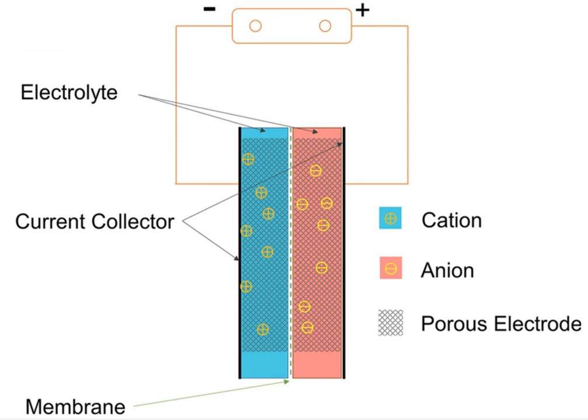The amount of charge stored per unit voltage in an electrochemical capacitor is primarily a function of the electrode size, although the amount of capacitance of each storage principle can vary extremely. Practically, these storage principles yield a capacitor with a capacitance value in the order of 1 to 100 farad.